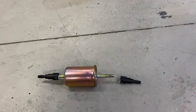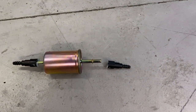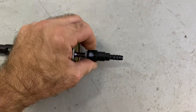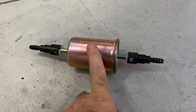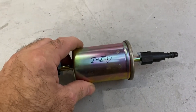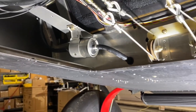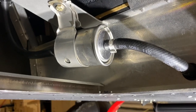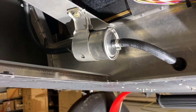Let's talk about the fuel system. This is the fuel filter that's now standard for everything on the Viking engine — even if you have an earlier engine you might want to upgrade to these. Put a little O-ring grease on the fittings; everything now uses a snap-together quick-disconnect type fit. These are our low-pressure filters and high-pressure filters — all three filters are the same, and there's a clear marking on the side indicating which way the flow goes. The quick-disconnect lets you replace the filter in a heartbeat by pulling off each side, changing the filter, applying O-ring grease, and sliding the quick-disconnect back on.